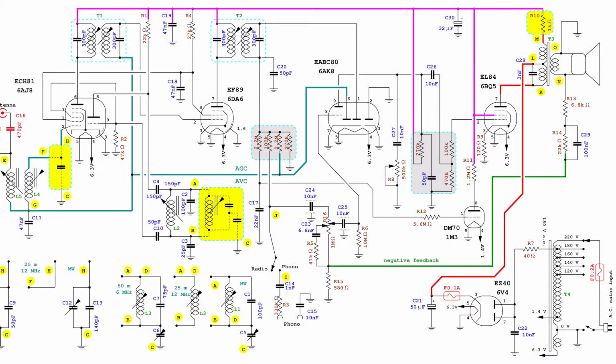This radio uses an unusual potentiometer, R16, with two wipers on the same resistance element. One wiper is used to fetch the signal for the preamplifier section, while the other side is used for the tone control. There is also a negative feedback connection between the tone control section and the loudspeaker, to reduce the hum generated by the audio section.